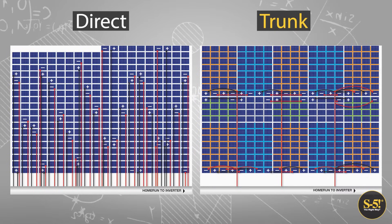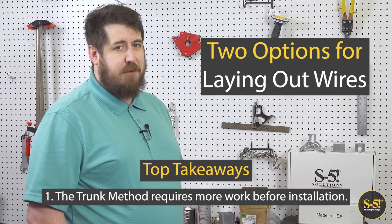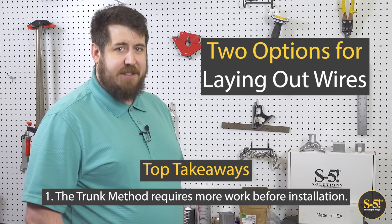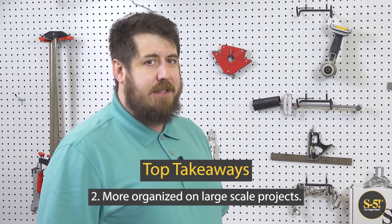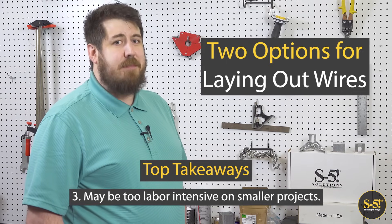The trunk design requires more planning before and after you get up on the roof, and generally requires the use of cable trays or conduits to protect the wires. So you must lay out your wiring on the roof before you install the modules. With this method, the trunks can be large bundles of conductors laid in wire trays, saving you labor time tying up all the conductors. While some hard goods cost is incurred for cable trays or conduits when using the tree trunk method, it greatly simplifies your wire routing and associated labor by eliminating the management of random strings all over the place. Let's compare the two methods. In the direct approach, you have to attach all the wires individually to the module frames or PV kits as the modules and PV kits are installed on the fly. Ultimately, you can save time and money by using specific wiring designs such as the trunk method. The trunk method requires more work to be completed before module installation because all the wires must be in place first. System size, however, dictates further consideration.